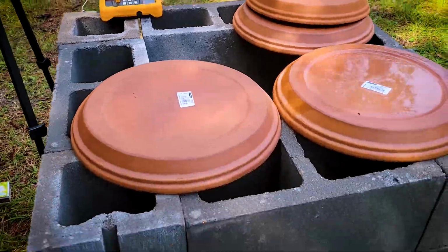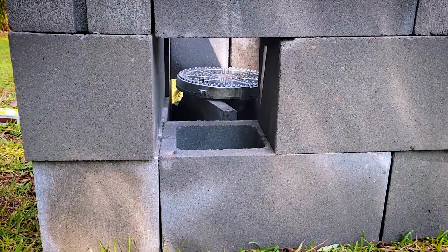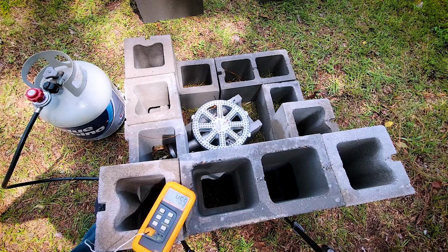So I started pulling the foundry apart brick by brick, because the more you pull it apart, the more it becomes just an open flame burner, and open flame burners should have no problem getting oxygen. But I found that the more I pulled it apart, the more my temperatures didn't change at all, and I still had the popping issue.